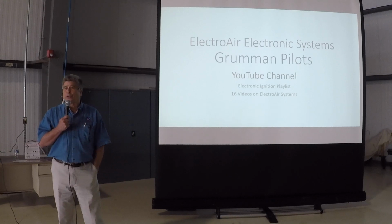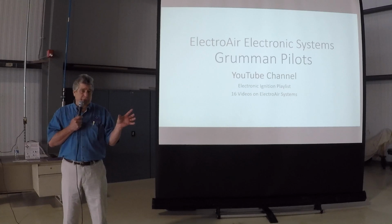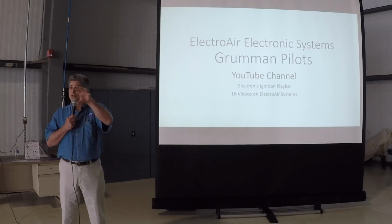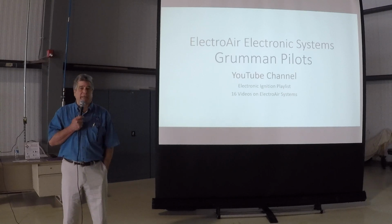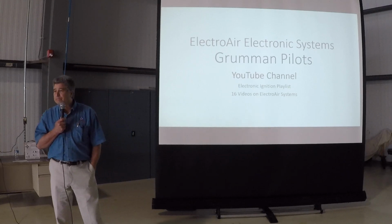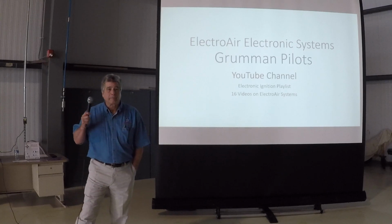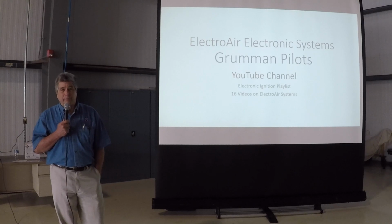I don't know how they're doing on the internal generator. I know they're working on that with the dual Bendix solution, which is for a lot of engines, you've got one shaft, you've got two magnetos. They're working on being able to replace one of the magnetos with an electronic ignition system for, like, the IO-360-P1Es. I would guess that once you get an internal generated solution, then the FAA is going to allow you to put both mags for even greater savings.